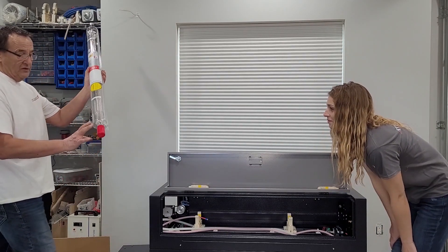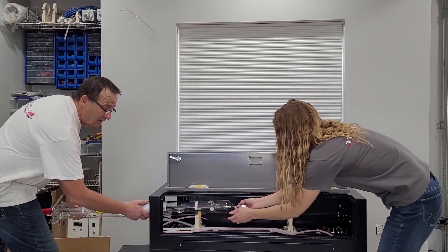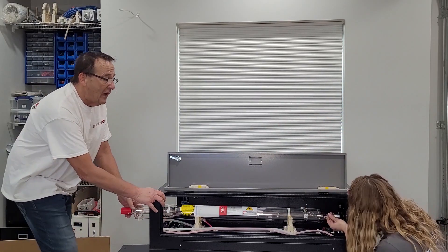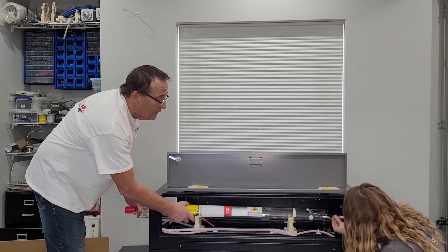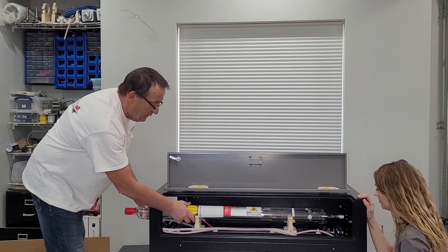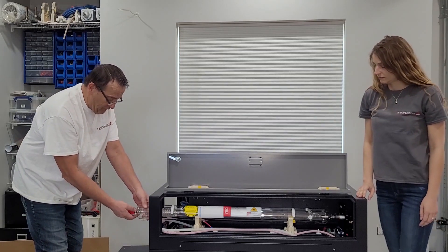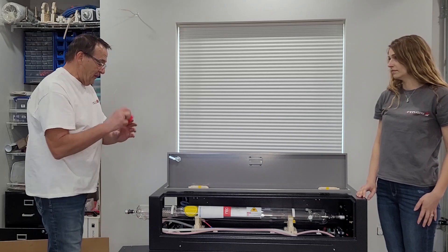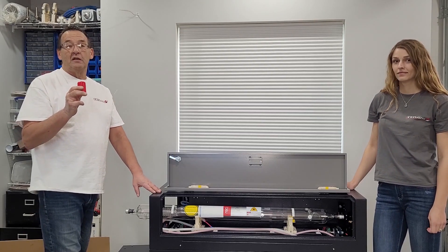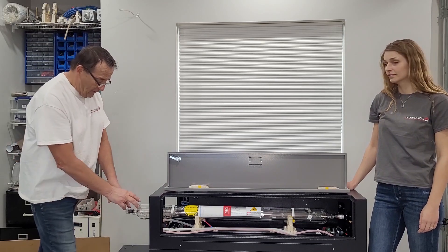The end with the red cap is the end that's going to get connected to the red wire. If you can grab that other end very carefully and bring it in — the end you're holding, you're going to want to bring it about a half inch away from the bracket that's holding your red dot pointer at that end. This is really important: the red cap on this end — don't lose it, put it someplace safe. You can never ever run your laser machine without this cap on. It's potentially dangerous to your health and it will destroy the laser machine. This is to prevent it from arcing — there's a lot of power in that tube and you don't want it arcing to the frame.